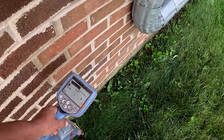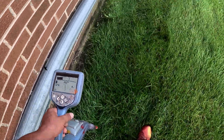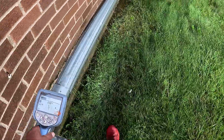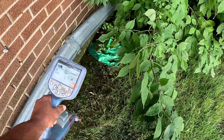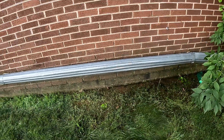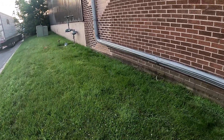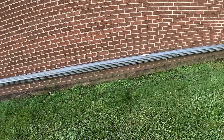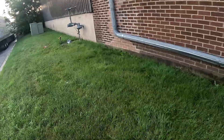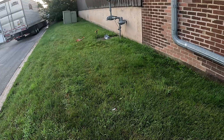Now somebody could say, 'Holy shit, I got it right here — 60 milliamps, six feet deep,' and they go trace it out not knowing they're marking something else. Now they're marking this gas service right next to this foundation — good milliamps, good readings — but they bled off on something else. It's definitely not the gas service running through by this foundation. And that's what I'm talking about — that's how damage happens.